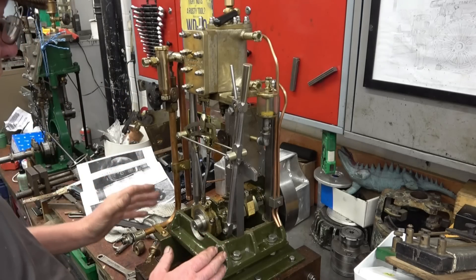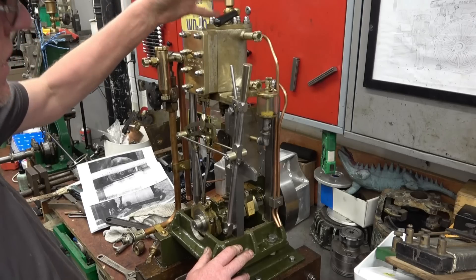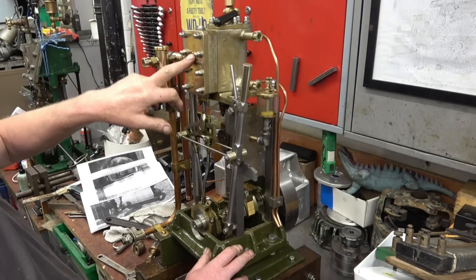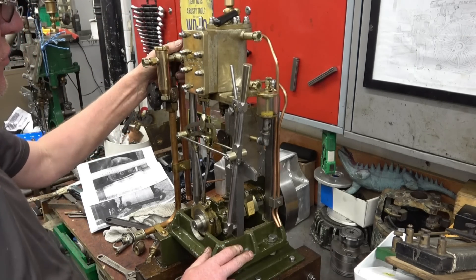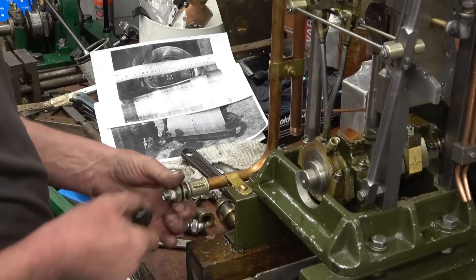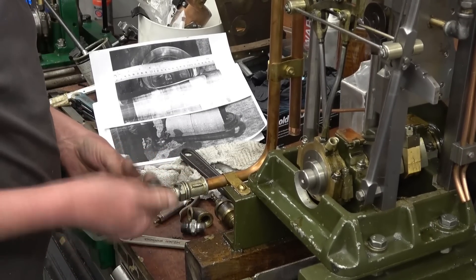The first thing I want to do is put some compressed air in and run it to try and get some of the water out of the cylinder, then put some oil in and run it again to get it nicely oiled inside. I might take the cylinder cover off and have a look inside — also the valve chest — I haven't had a look in there for ages, and this has done quite a lot of running. This isn't ideal where I'll connect the air — that's a parallel thread, it should be a taper thread in there — but I'm sure it'll be alright for what I need to do with it.